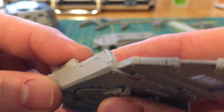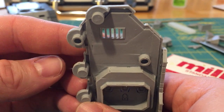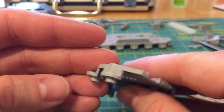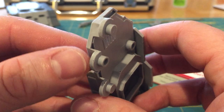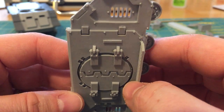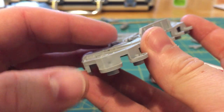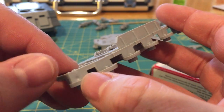I'll show you where I've got some — you can see here, that's not particularly tidy, and there's an air bubble, there's an air bubble. You can see that's from being that way up. This section here is going to show, so the first thing about filling is — is it going to show? Yes, here. So that's not particularly neat, so I'm going to build that up. There's a little void to fill there, and there are a couple of spots along these wheels as well. I don't need to worry about internal detail on this. There's one other thing — the opposite of a bubble is like a suction defect. You can see one here — that sort of pulled-in point where the resin is pulled in; the mould's got distorted at that point. So I'm going to fill that as well.